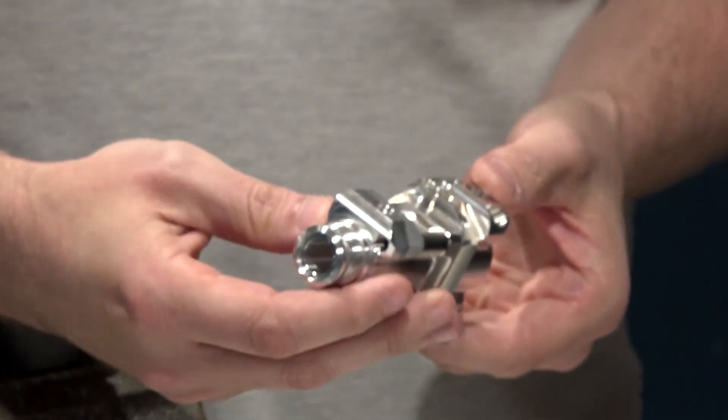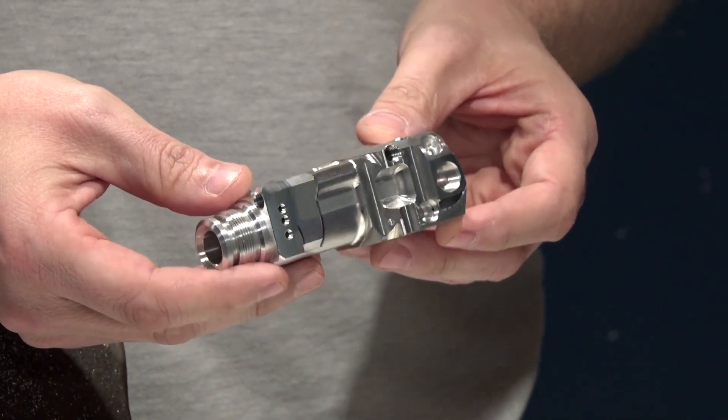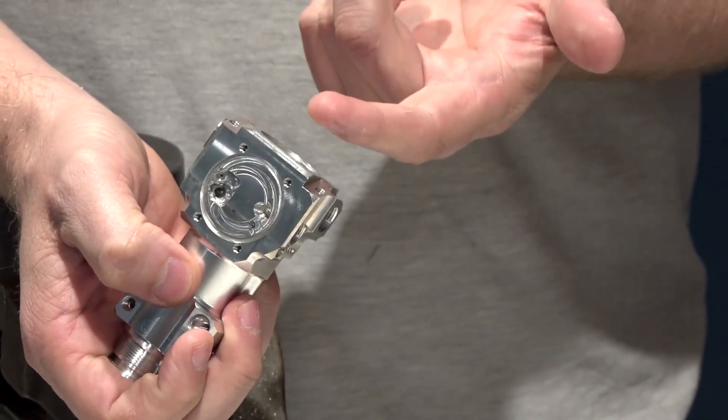I really like this component here. If you were a machine tool manufacturer you'd probably want to use something like this as an example of what your machine can do — it's a great component to demonstrate a five-axis machine. That was done on the 520 PC4, in just over an hour — around an hour and twenty minutes. We've also refined the process: there was a bore in there we used to have to get honed because of the finish on it, but we now burnish the bore, getting a nice finish. The job comes off in two ops. And you couldn't do a part like that without a five-axis machine — well, you could, but it'd take forever, you'd probably end up with a lot of scrap, and it wouldn't look right — it would look awful.